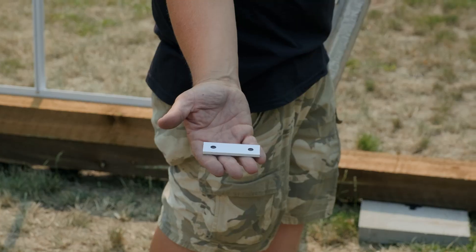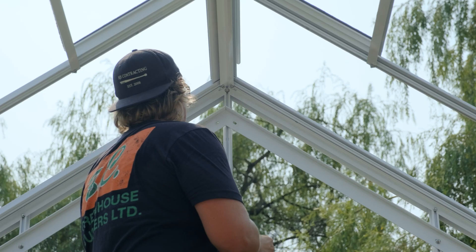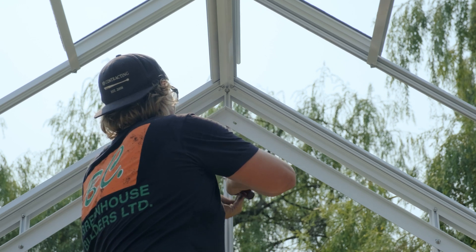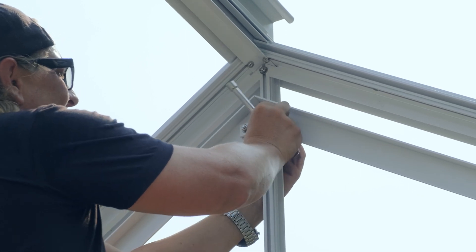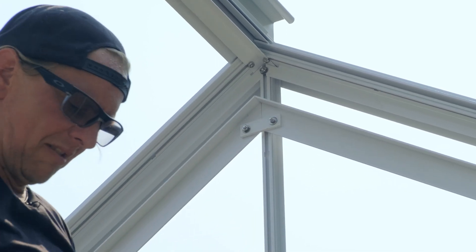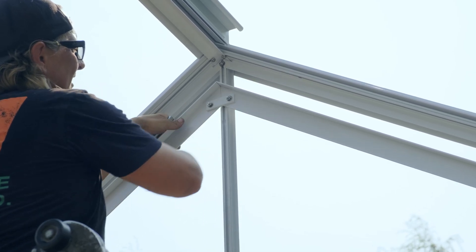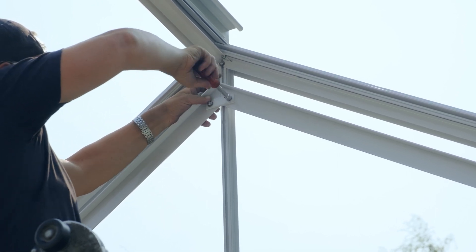Now the last part is a little one-inch plate. That goes at the top of the peak to join them together, and that'll also get three-quarter inch bolts, nuts and washers. It might be a little bit off — you can move them around and just make it fit snug and nice. Not gonna break anything, it's not the end of the world. Just make it look pretty.